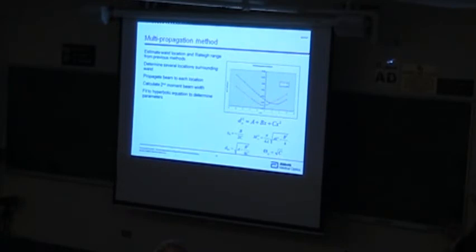It is a little sensitive to the camera background thresholds. If you have any background light, then it's really a property of the M squared calculation itself, which is a second moment calculation. It weights a little bit of noise in the corner you're seeing very heavily. So you need to be very careful to get the thresholds right and not have any stray light in there.